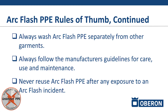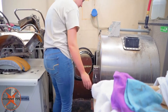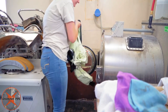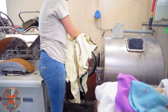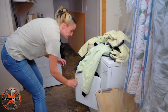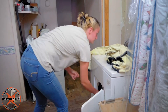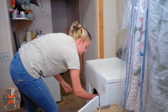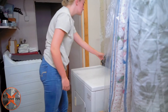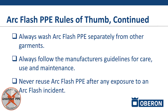All electrical-specific PPE requires a pre-use inspection. Always wash your ArcFlash PPE separately from other garments. If you have FR clothing as part of your daily wear or uniforms, you can group that together with an ArcFlash suit. We just don't want you washing non-FR or non-arc-rated clothing together with your arc-rated clothing. There can be cross-contamination in the washing and drying process — for example, lint from non-FR garments could make its way into an arc-rated garment and extend the after-flame if you were involved in an ArcFlash.